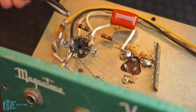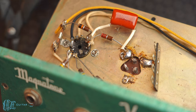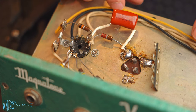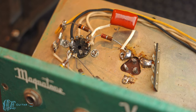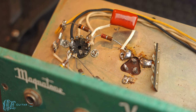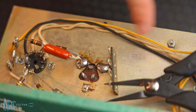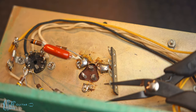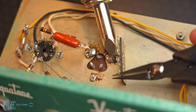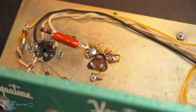It's a pretty ball of solder there. So I've got the beast heating up right now. We'll come back once that's ready to go, and then we'll take this joint off, at least enough to lift this. I'm gonna leave solder there to just keep the pins down, because I want that to stay solid. So my goal is basically just to heat this up and then use this to pull this up and off. So we'll see how well that goes. So that came off fairly easily.